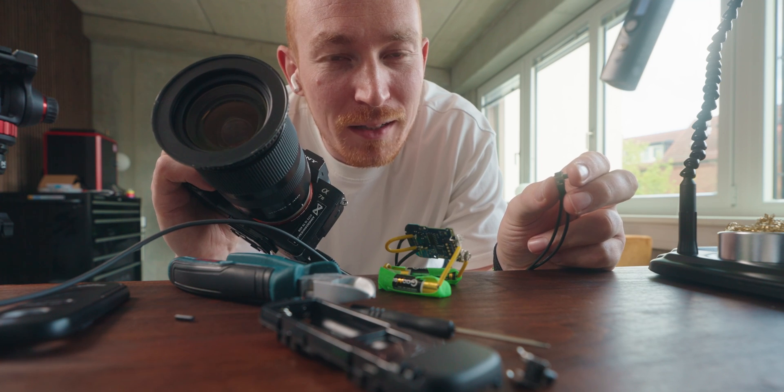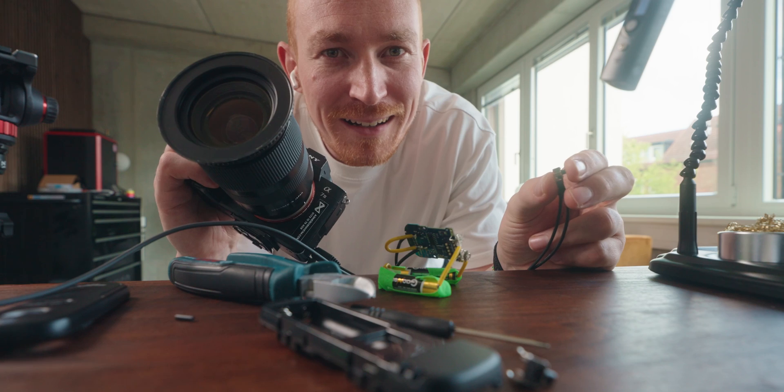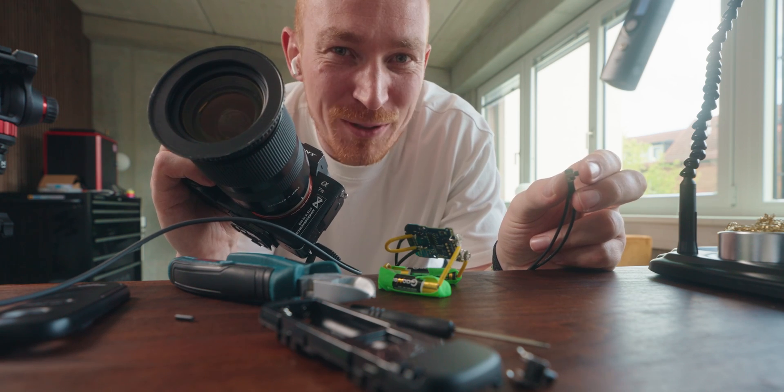Sadly, I just learned something: this is a two-stage button. You can press it halfway for autofocus and then all the way for the shutter. Mine is only a one-stage button and I soldered it to the autofocus, so it can autofocus the camera but can't actually trigger the shutter. So I need to re-solder this to the other pin. After a little more trial and error — that sounds pretty good. With that we're done with the remote trigger part, so now I just have to make a case for the button and put it in the printer.